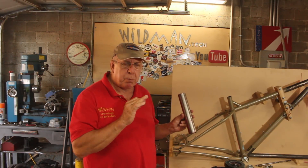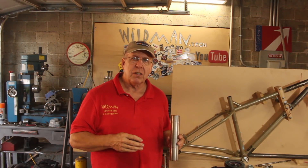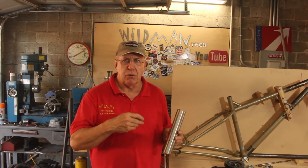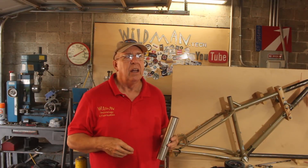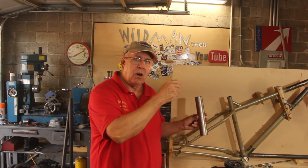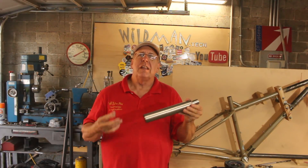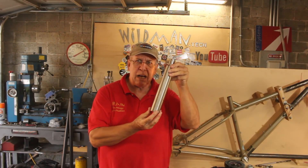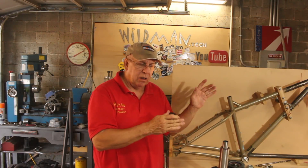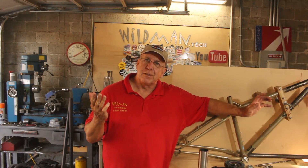The frame fit and fixture is all pretty much done. All that's left now is to disassemble it, clean all the joints where there's going to be welds, wash them with acetone after all the paint has gone away, then put it all back together, have the welder come in, tack it all, then remove it from the fixture and weld it up. The next video will include the complete assembly of the rear handlebar holding apparatus, tacking of the entire frame, and welding it all. That's all for this week — we'll finish this up in the next video, thanks for stopping in.